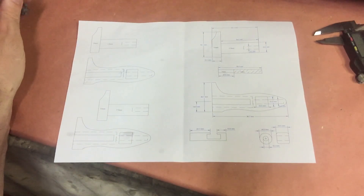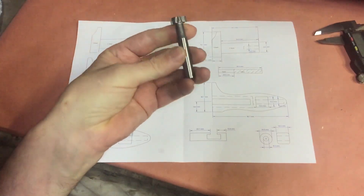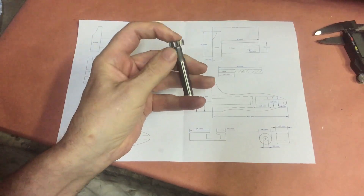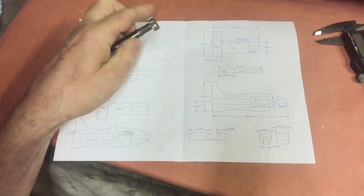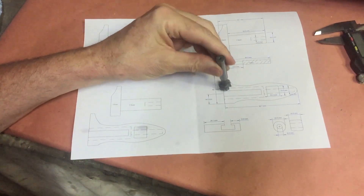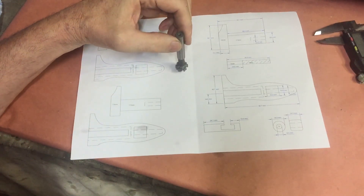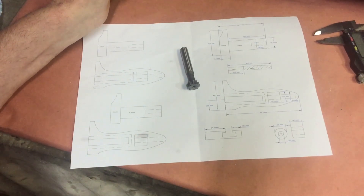Based on the picture, I've drawn out what I think is probably the right sort of scale. The only T-slot cutter I've got is this one and it's 6mm by 16mm, so I scaled everything to match the cutter. The material I'm going to use is 10mm thick steel and hopefully I'll make a success of it.